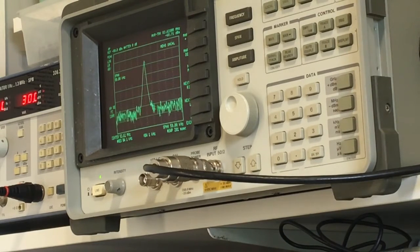All right, now I can turn this down. You should try and get this as low as possible. So that's at minus 79 dBm now. All right. If I go a bit further the other way, maybe that'll do better. No. So that's as good as I'm going to get. It's minus 79 dBm on that trap circuit there, using the adjustment only.